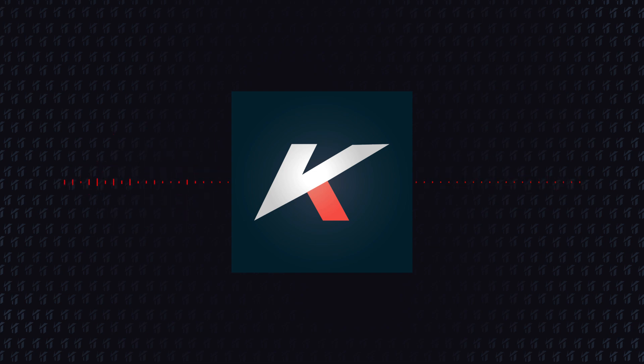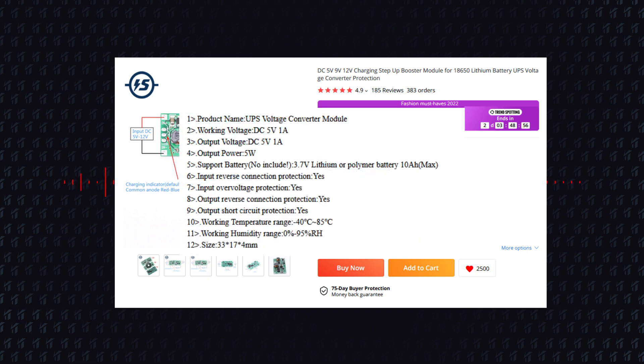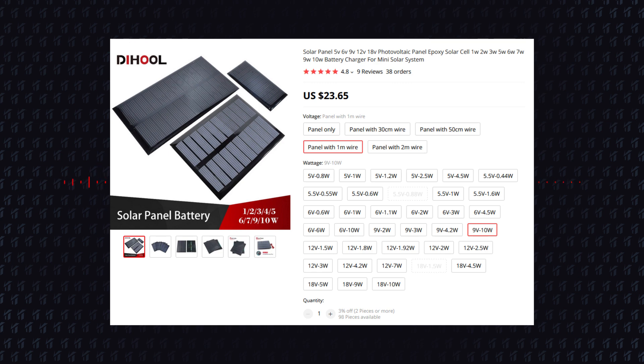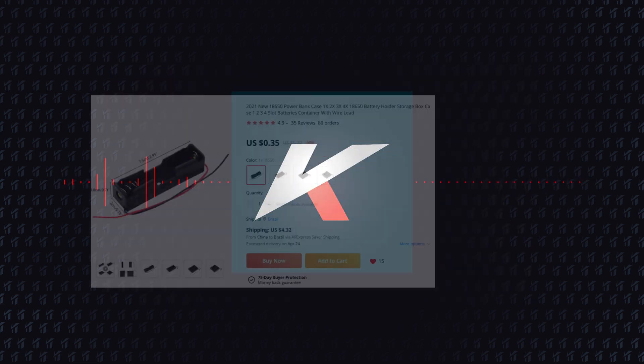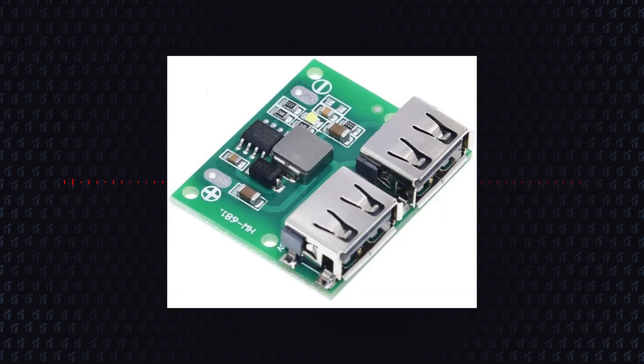So I went shopping, and this is everything you'll need to make your solar charger. You'll need one battery module — this module comes with all of the safety protection you will need for the project. You will need a solar panel; ideally you should get one with an output of 12V max, since this is the max input for the charger module, but be careful as they can sometimes output more than 12V on a very bright sunny day. So in this video I'm recommending a 9V solar panel. One 18650 rechargeable battery — these are very cheap and easy to find. A few P4 connectors, which can easily be found in electronic stores too. And one step-down USB module, which will step down the voltage output from the charger module to the correct 5V that the Switch and other general devices need.